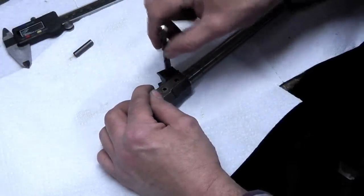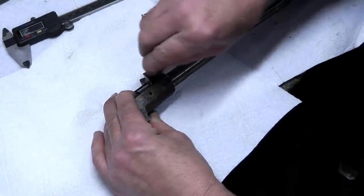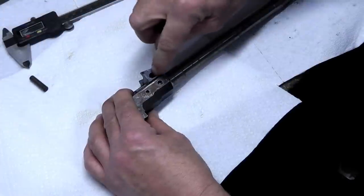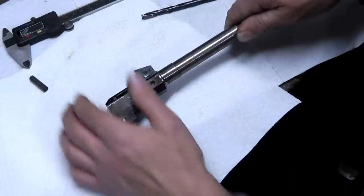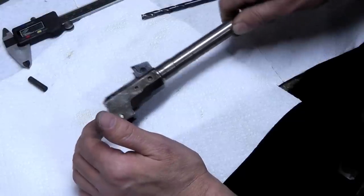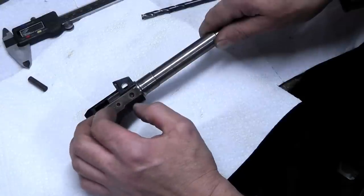Put the shank inside the hole and you've got a ton of wiggle room. Put the barrel pin in and obviously it doesn't even want to begin to go - it's a press fit. It's at least a thousandth of an inch larger than the diameter of the hole. Hopefully when I'm done you'll be able to reuse this barrel pin. If not, I'll turn a slightly larger one on my lathe.